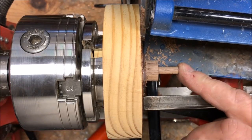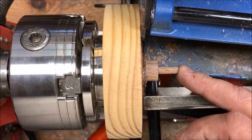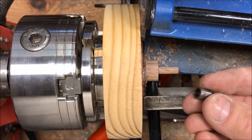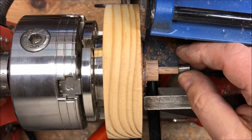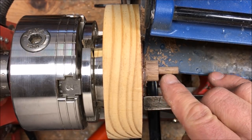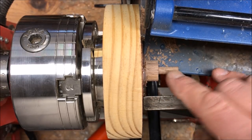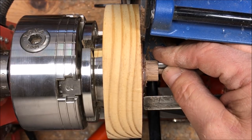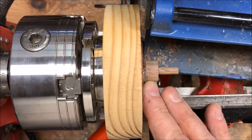The inexpensive wrenches I use for tenoning are known for not being the exact perfect size. So when you take a 7 millimeter bushing — the kind you would use on any slimline pen — it should fit on a quarter-inch shaft, but when you try to slide it onto the end of your dowel it's not going to fit. So we're going to take just a little bit of 120 sandpaper and clean this up so the bushing will slide all the way on and be flush with the back side of the finial cap we're making.